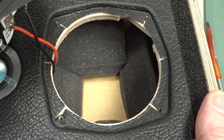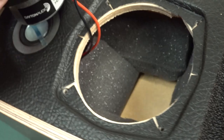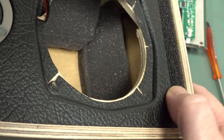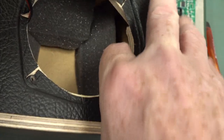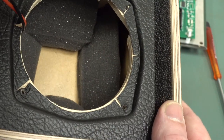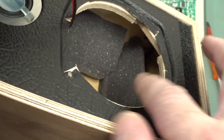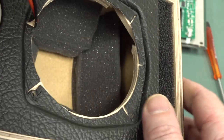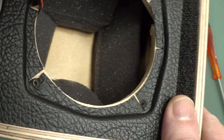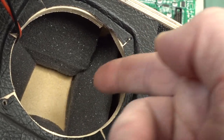And that's inside the woofer section of it, just got some foam surrounding that. Nothing special, but it's trapped fairly well in there, I'm not sure. And then it's got to escape over here, and it goes through the foam, low frequency stuff. This foam's not huge, not gonna stop much at the low frequencies, so yep. Anyway, it's got to get over there, and then it's got to effectively split down the acoustic wave guide, the transmission line, but also some of it sneaks over the back as well into the electronics section.